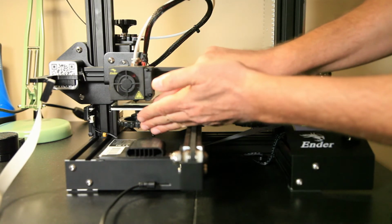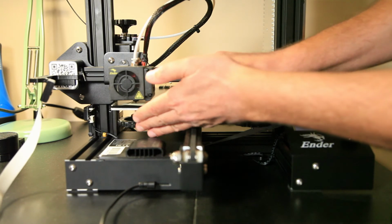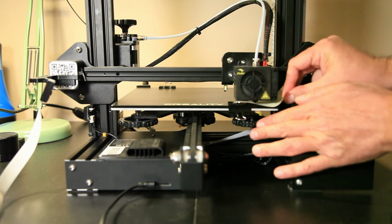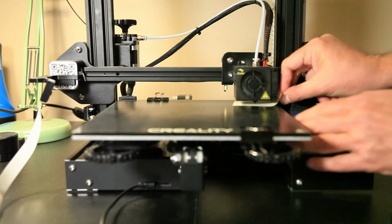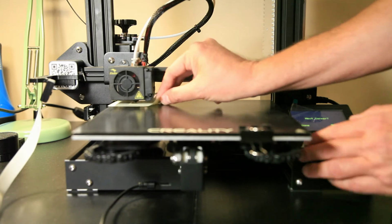The reason for this is that the wheels-based leveling is great as an overall macro-style bed leveling, whereas the mesh bed leveling is much more granular and fine-tunes how the printer interacts with the print bed. So leveling the bed with the wheels is a good foundation for mesh bed leveling, and I would definitely begin with that. Once you're done leveling the bed using the wheels, move on to the mesh bed leveling.